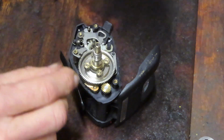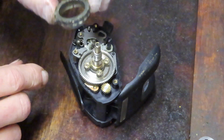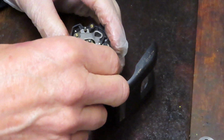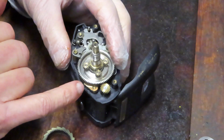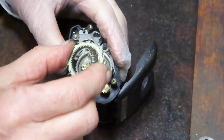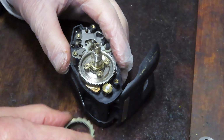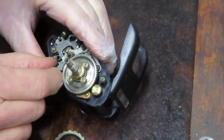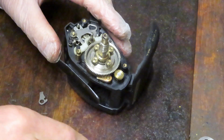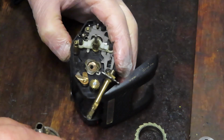I guess what this is telling us is as you press down, this inner ring is going to engage and change the gear. So if you're not pressed down, the main drive is going to be this gear, and this will be floating and acting as a clutch, and as you go to put this in and press down on this, then you're going to have the other gear engaged, I think. All right, I'm going to take that dog off. Pull this whole assembly off.